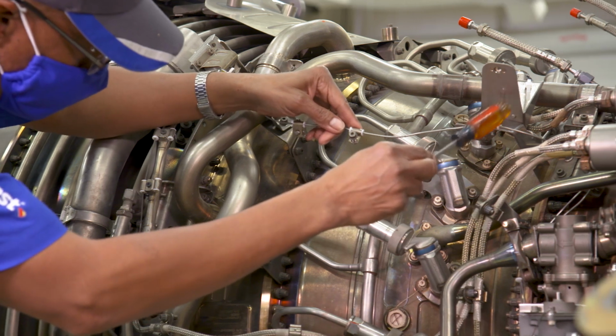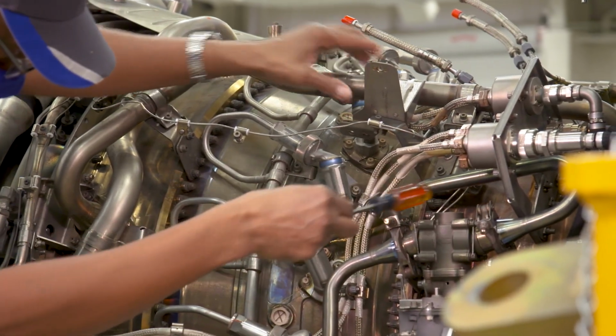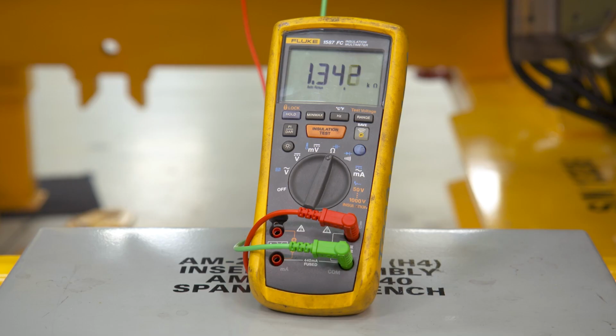Shake down the harness from the DJ2501 or DJ2601 connector to each of the detectors for the faulty loop. While your helper is doing that, keep a close eye on your meter. When the faulty detector, connection, or harness is found, you will see a large fluctuation in measured resistance on your meter. If you saw the meter fluctuate during the last procedure, then you have found the problem. Well done. If the meter was steady the whole time, then we have some more work to do.